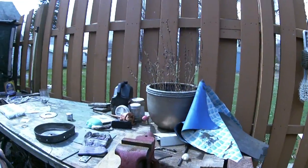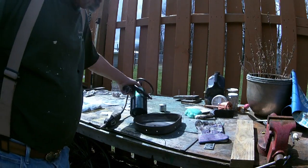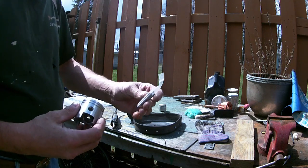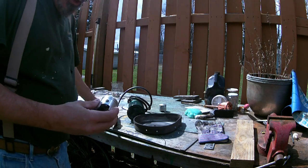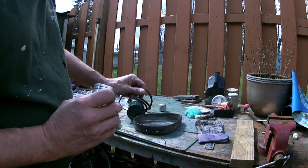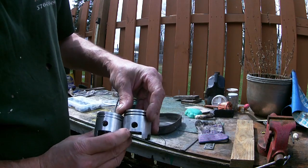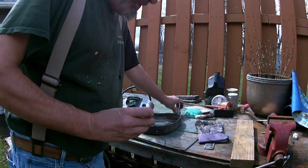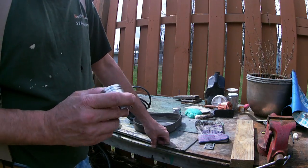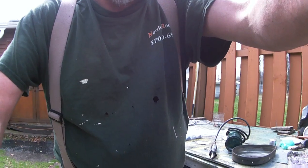I like it. But for you guys out here, I've been getting a lot of calls about the bad wrist pins and pistons. I stock my own. I get my own wrist pins. I don't make them. The hole, even on this new piston, you can almost see that that hole is undersized. But what to do once you understand that when you have a bad piston or a wrist pin, a lot of people will have the bicycle, the rear wheel will be locking up on the bike.